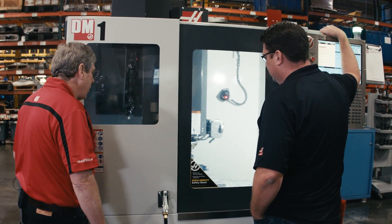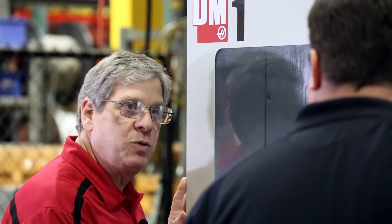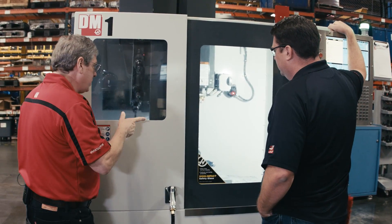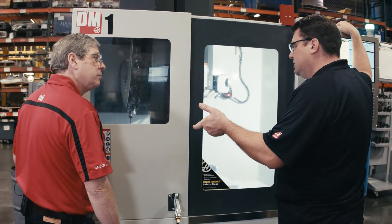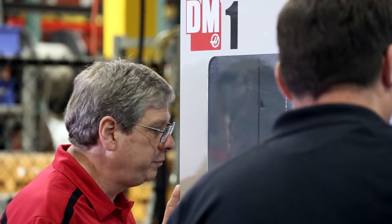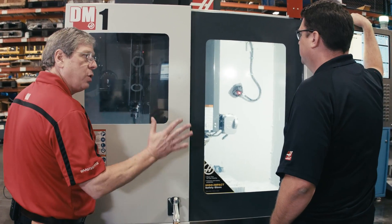That tool change speed is fast — very fast. And the carousel rotation is really nice, super fast. It doesn't stop at each pocket; it zooms right to the next tool, going right to that point instead of incrementing one position at a time. That's especially nice if you have an operation that just takes a few seconds to cut a really shallow hole or do a one-operation drill or tap. I notice there's no tipping pocket, so that also shortens the tool change time. The short arm tool changer decreases the time of the tool change — it rotates much faster. How many tools can we hold? This is 18 plus one in the spindle, so a total of 19 tools.